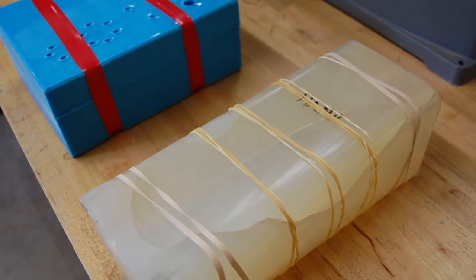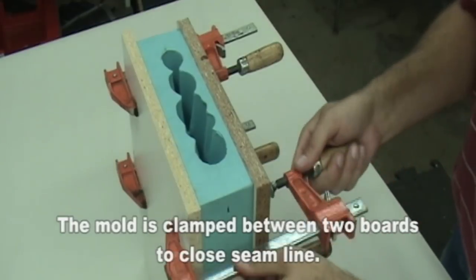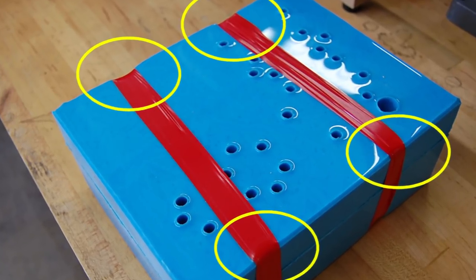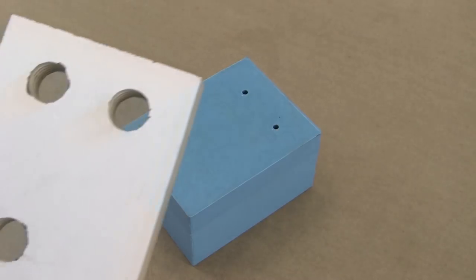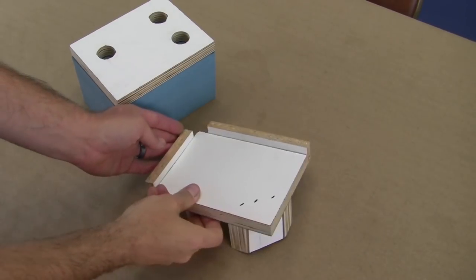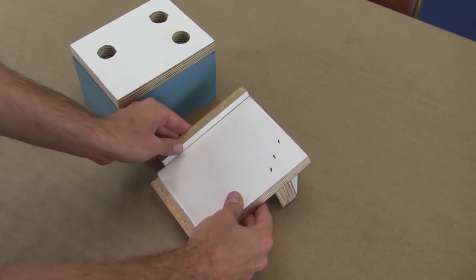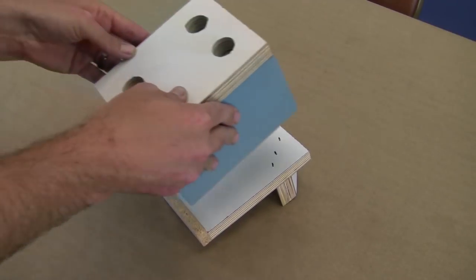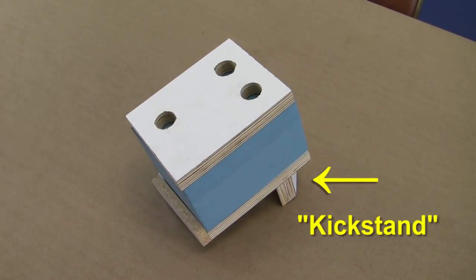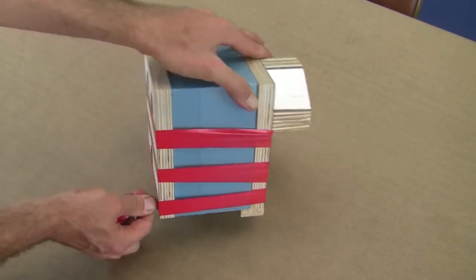Clamping the mold together presents a few options. Many people use tape or rubber bands to secure the mold halves, and some clamp between two rigid boards. If the silicone mold material is fairly flexible, tape or rubber bands may pinch and distort the mold, altering the interior geometry. We prefer the even pressure of clamp boards, so we've made a custom cap with holes for our fill port and vents. We set the proper mold angle to avoid trapping air bubbles, and we securely attach a small piece of wood under one corner as a kickstand so the base doesn't slide during filling.